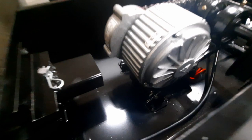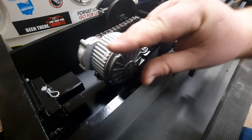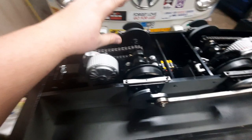If we look down on the bottom, just below that motor housing here, you can see that there's a pin that goes through, while underneath that motor mounting plate, there's a clevis shaped bracket. So when the suspension moves, it just slides along that pin in that clevis bracket. So kept it pretty simple. And also, if one of these motors goes bad, since they are a Chinese special, I tried to make this somewhat serviceable. So that pin can be removed in just a couple of steps. The motor will then swing down if this is on a service bay and be accessible.